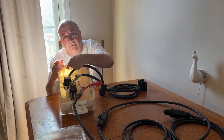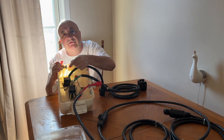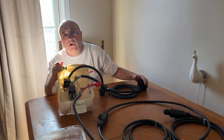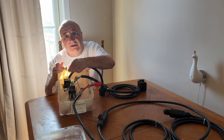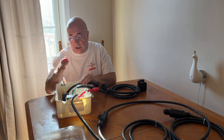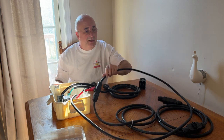This is a switch that detects current, and you can adjust it. You want to adjust it for your maximum inverter current. With three HMS 2000s, that's 24 amps. So you want to make sure your load current is greater than 24 amps — though that's probably a lot to ask. What you would probably connect here are two HMS 2000s and one HMS 1000 or 1600, so you're below the 24 amps. You'll set this for that limit, say 21 or 22 amps. If the load on this cable is greater than that, it will turn on this relay, connecting your circuit and your PDU to this cable or group of three microinverters.